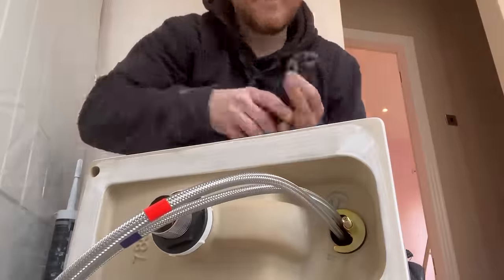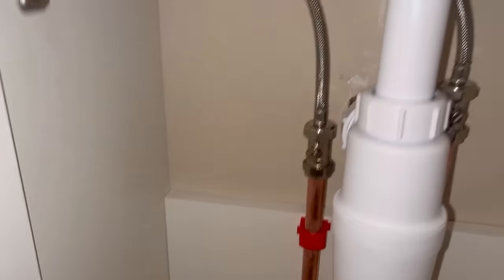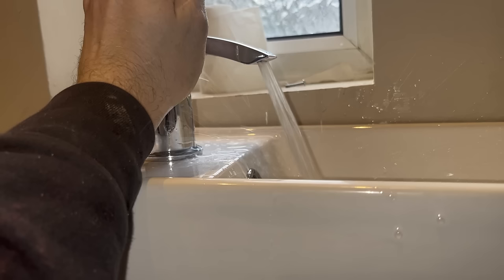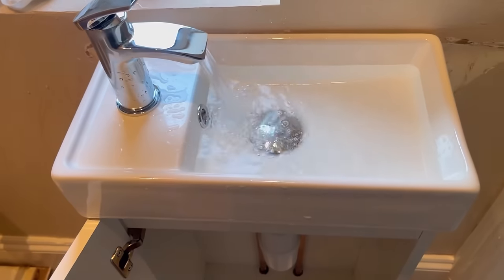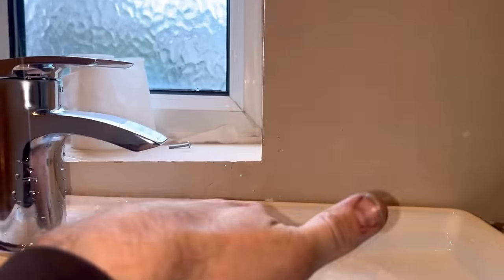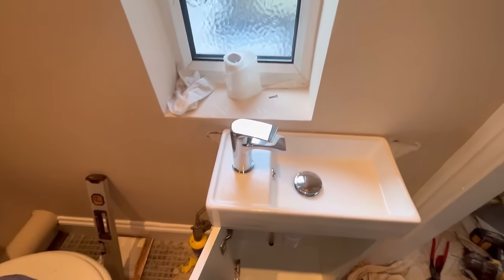Get the big wide-jaw adjustable spanner — it works really well on those wastes. Then we're going to put a tap in, give that a tighten up, and that's ready to put on. We clip the hot and cold flat-face isolators on, waste is ready, put the door on, put the basin on — there we go. Just letting the pressure out — the pressure is really high so we turned that down. Looking at the windowsill, it's actually running out the opposite way to the floor: the floor runs one way, the windowsill runs the other. I think this house has dropped over time.